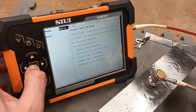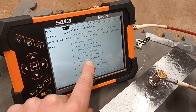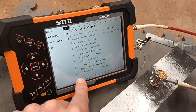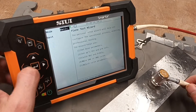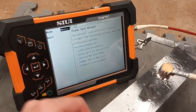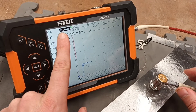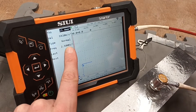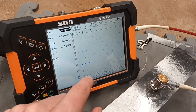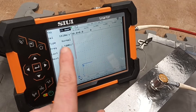We're just setting up the basic profile. The probe profile works through a dual crystal probe as one of the setups, but in the basic mode it's a single crystal probe like we have here. It's going to ask us details about the materials. Setting up the velocities will give it all standard presets, but it will also be calibrating it as well.